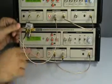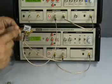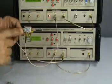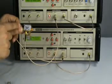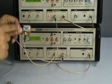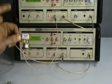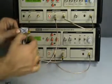Now we have connected the source at the input port and the receiver at the coupled port. The receiver is measuring the power at the source with the insertion loss because of the coupling factor. The power level right now is minus 56.3 dBm.